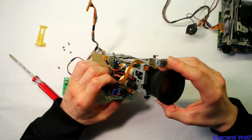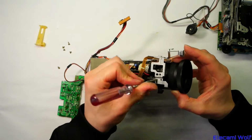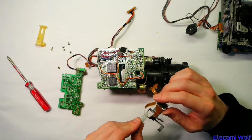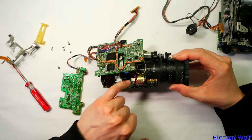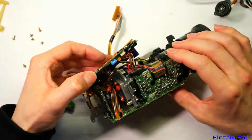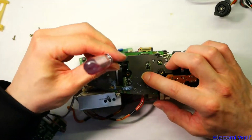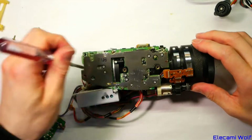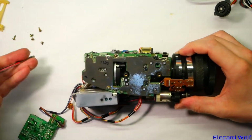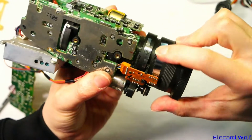So that white balance sensor there, it's got a flex cable coming off of it, which goes all the way around and plugs into their little light sensor thing. And then there's a 2x3 connector there, board to board, which plugged onto there. And then there's another one there going down to this other board on the other side. It's got this interesting shielding plate on the back of it. Look, and then there's some sensing there about where you're zooming and focusing. Some little flex board, and then there's some reflective strips there.